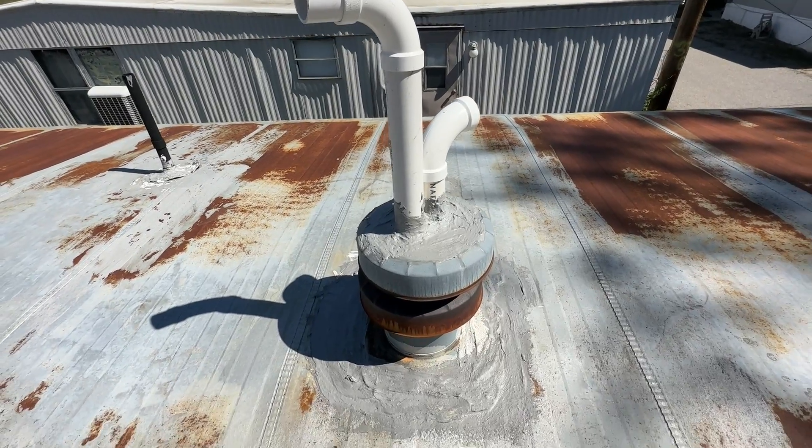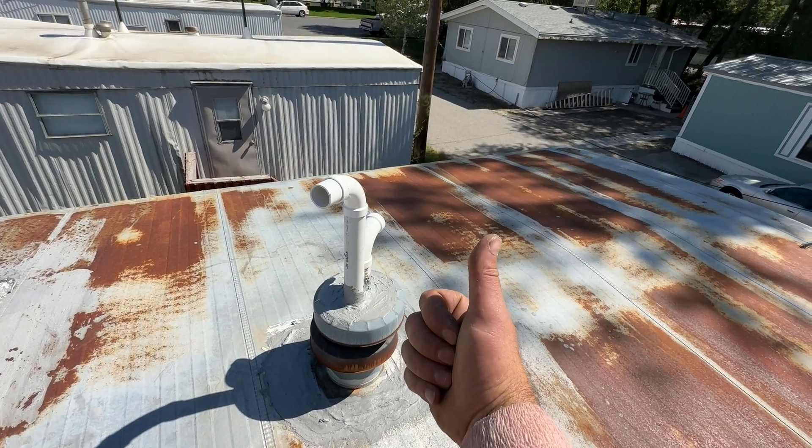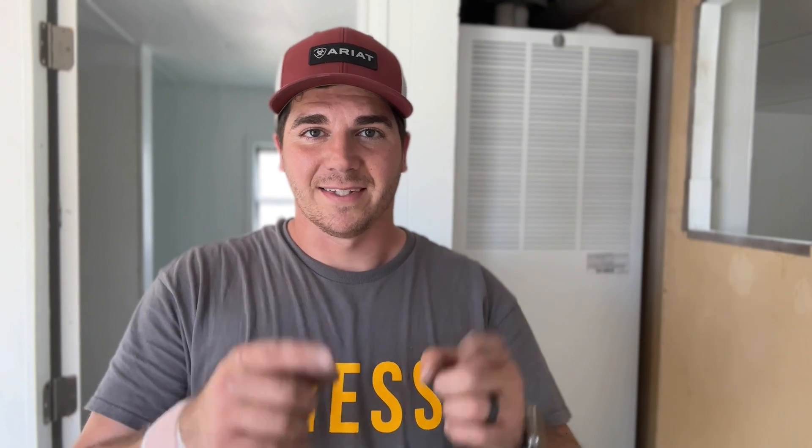Here's our finished product — everything is sealed up and the roof jack is sealed too, so this job is 100% complete. It's as easy as that to install a 95 or 96% furnace in your mobile home. The PVC venting was really easy and we could reuse the existing chase that most mobile homes already have. The only real difference is running that condensate line outside — away from the foundation — and you're good to go. I hope you found this helpful, and if you'd like to see how to do an 80% furnace instead, check out that video. Until next time, be safe.